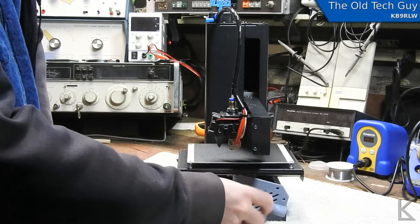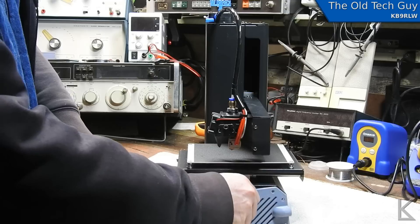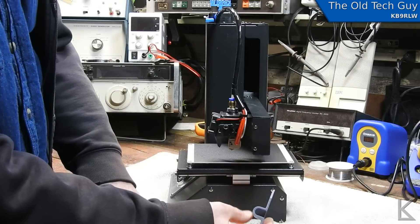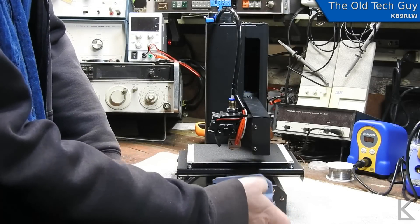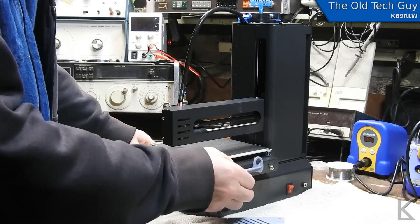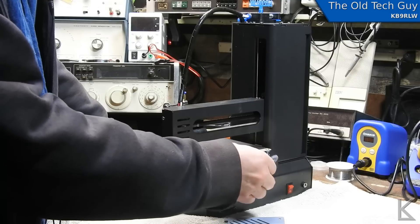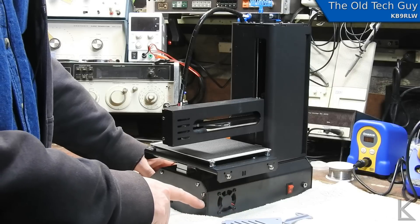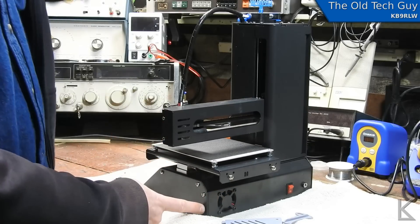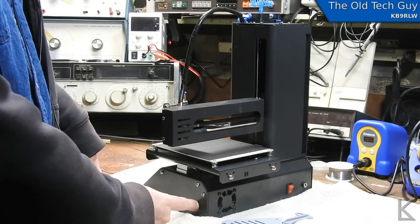What I'm going to do is reroute the wires from the back of this bed externally into the corner of the case, because where they hook up on the PC board is right near that corner. I've already printed out a couple of modification parts for that. This is a replacement for half of the side panel — I'm going to print the other half after the modification is done. This will replace the side panel and give a nice little hole where I can put a grommet and have the wires come inside and hook up. And this is a strain relief that will bolt onto the back of the bed, giving a spot for the wires to come out through a grommet, loop lazily, and back in — resulting in very little flexing. There'll be no flexing where they connect to the board or where they plug into the controller.